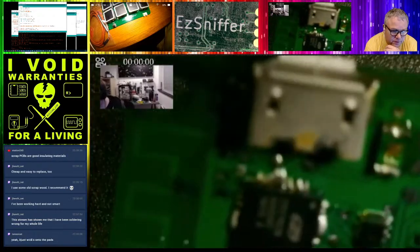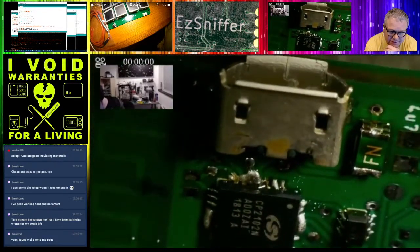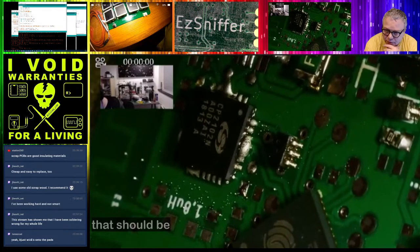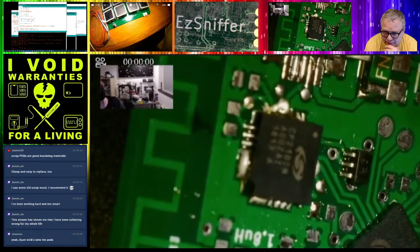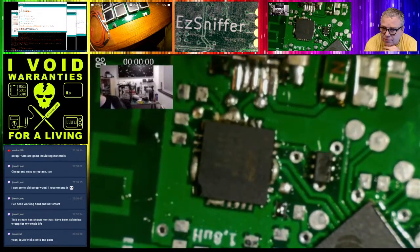Main thing I need to check is alignment, because I didn't keep it in place. So yeah, it's roughly in its spot where it's supposed to be. A little bit of wick. Or maybe not even wick. Just flux and the tip of the soldering station is enough. As I'm always showing, let's increase airflow, lower temperature, because the hot air gun needs to cool down before I can switch it off and switch to the soldering station again.